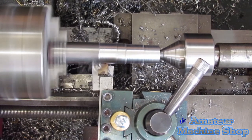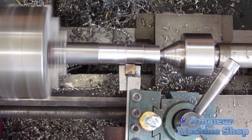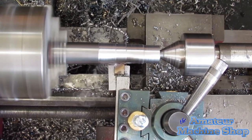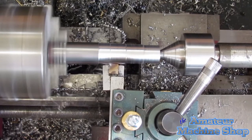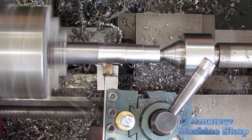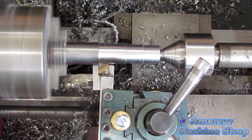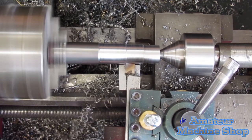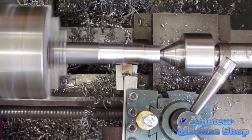Some further modifications are needed to the tool bit clamp to allow the tool to get closer to the cut area and the chuck, should the need ever come up. Adjusting the RPM allowed for a few decent cuts. Using too high of an RPM along with the vibration caused the bit edge to wear down.